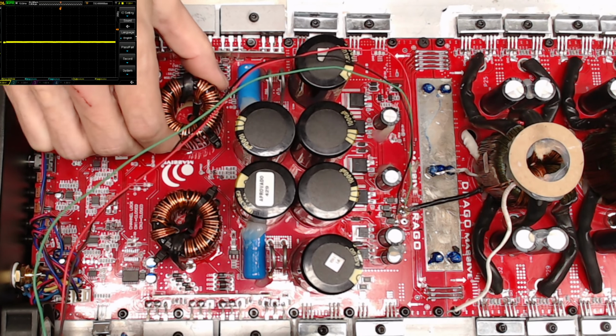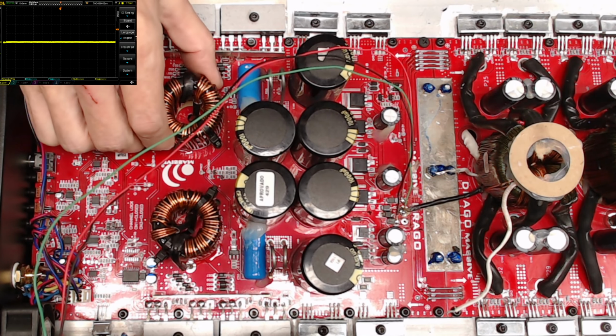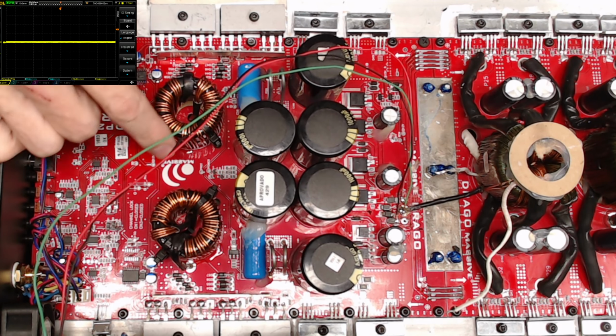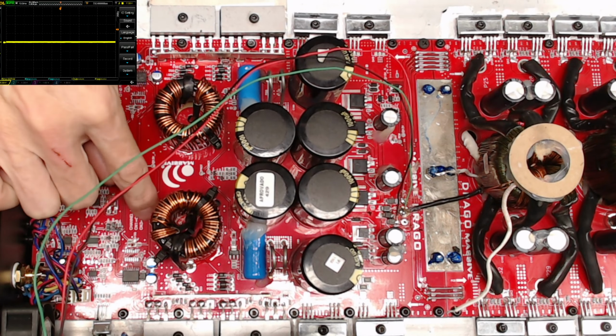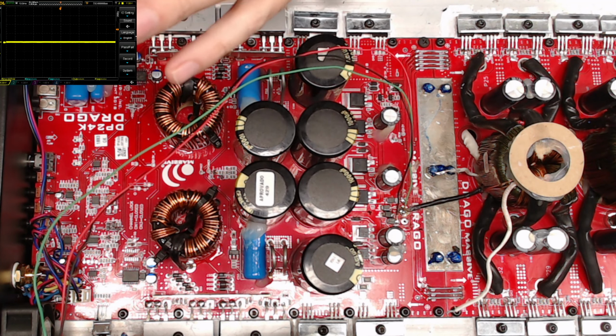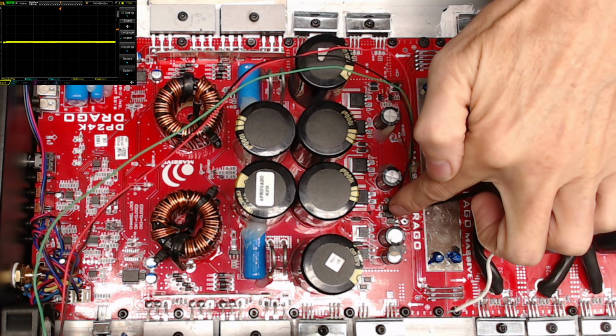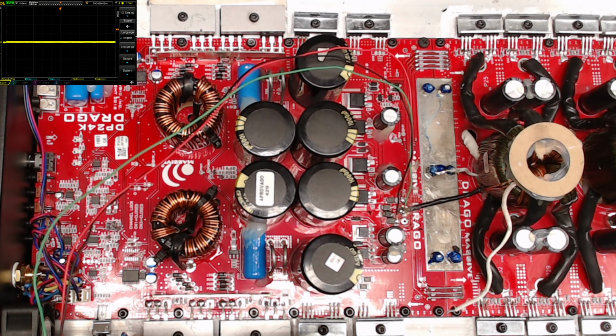The inductors are beyond, like, I would not even consider them remotely adequate, so I did end up gluing these down last week. But I'm at a fault in the auxiliary power supply. When I first brought this to the test bench, all my measurements were spot on, so I felt good, fired it up. Well, I lost the rectifiers over here, the discrete diodes. It's set up as a bridge rectifier.